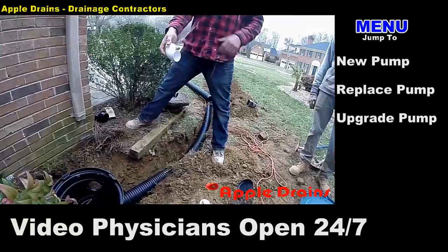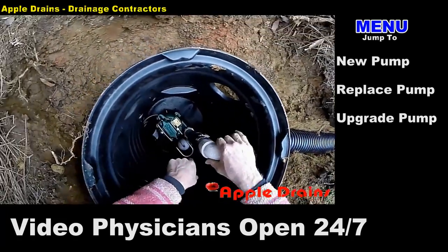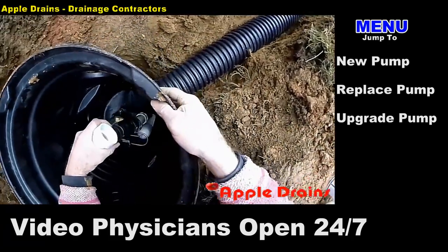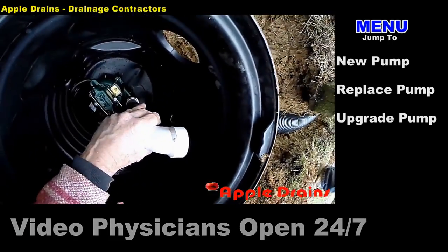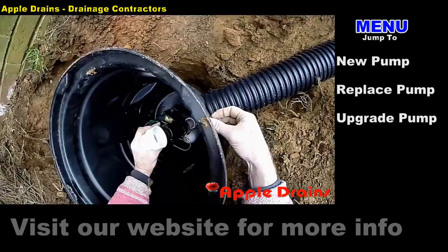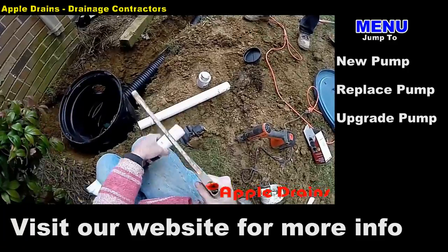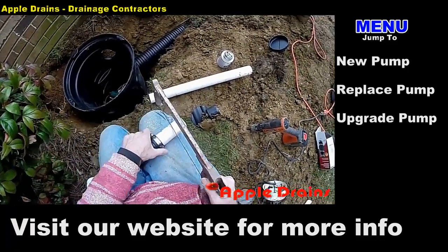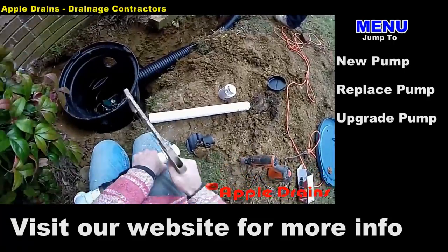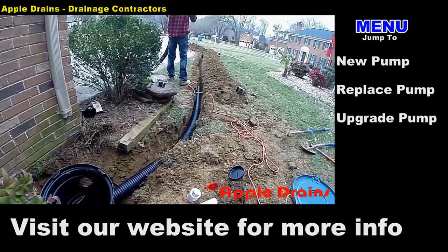Have your glue handy or have someone hand it to you. Now we're just making the measurement — I'm a little bit too high. This is just barely below the surface and I want this discharge to be very safe and underground. It's just too high on the side of the pit, even though that would be underground. Let's make it a little bit deeper. I've only dry fitted things so I can easily pull them apart. I'm going to cut off about a couple inches of the riser from the discharge of the pump and re-plumb this so it's a little bit deeper.